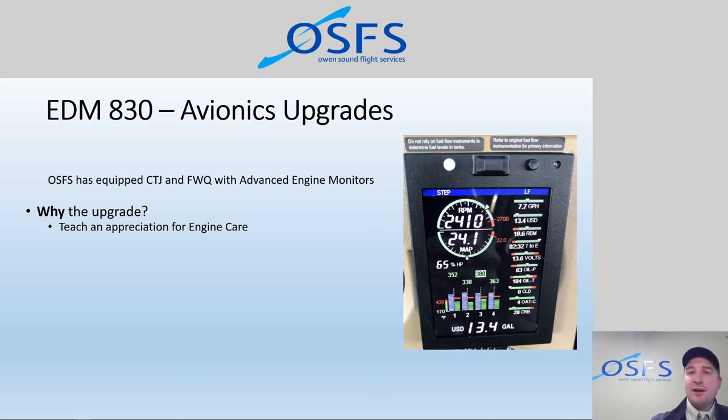But I think we can even manage that engine system better if we can monitor temperatures and temperature changes, temperature shifts. We can better care for the engine by keeping those temperatures in check, so not getting too hot, not getting too cold, not making abrupt changes. We can also prolong the engine service life by doing that, so we can gain more time out of the engine and operate the engine even further past TBO more safely to a point if we can have more data. The key is data and information so that we can constantly evaluate what's happening in the engine.